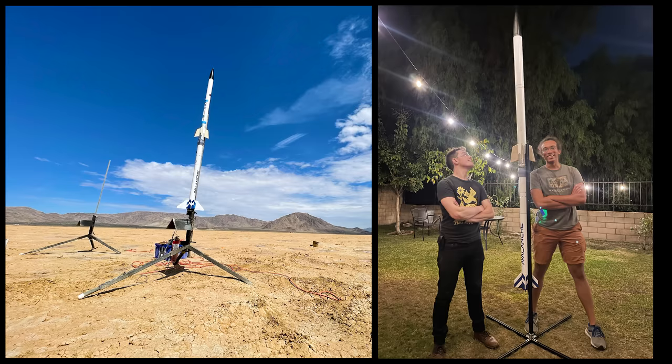For the last flight here, I focused a lot more on the code and a lot less on the external stuff. I restructured a whole lot about how AVA's Kalman filter works. The Kalman filter takes data from the barometer, the accelerometers, and the GPS, and fuses them all to come up with the ideal estimate of where our vehicle is. All of those sensors have some amount of noise, and so we can trust all of them if we define how much noise they each have and how much certainty we have in them — that's the job of the Kalman filter. Tuning a Kalman filter is one of the key points of the Avalanche testbed.